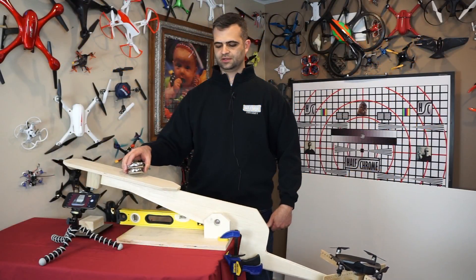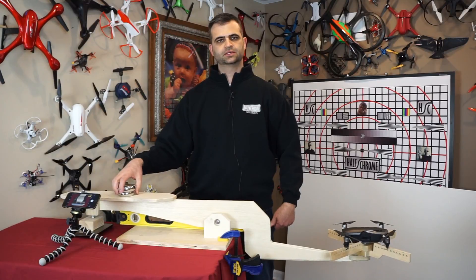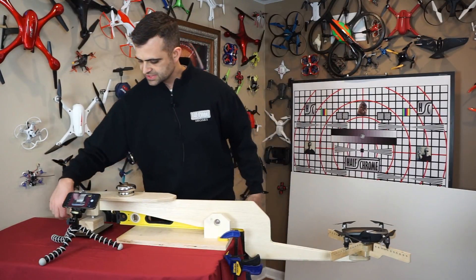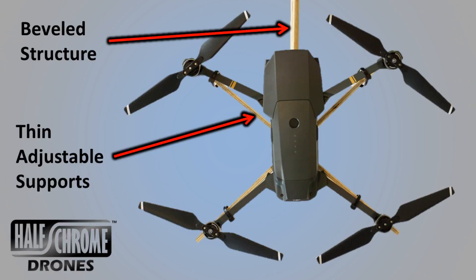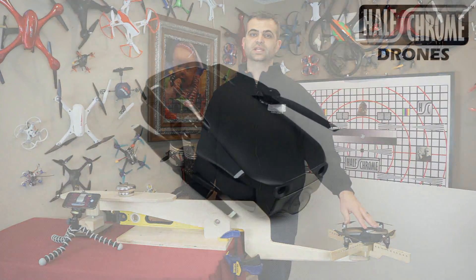Now I need a little extra weight here, otherwise the drone just falls down like that, but we can get rid of any bias in there just by simply zeroing out the scale. When we videotape the scale — that's our goofy kind of data collection method — we go through the video, pull out the highest number, and that's how much thrust this can generate.